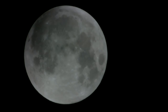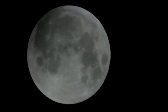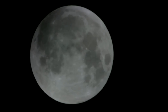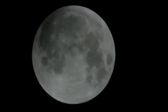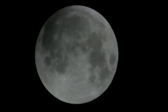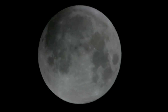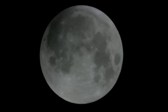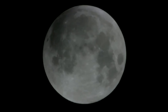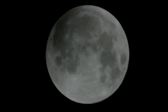We get a total view of the moon when adjusting the zoom to approximately 130mm, which equals 1200mm with the Raspberry Pi camera module. Making that homebuilt telescope point exactly to the moon is very tricky with that cheap construction. Considering the rule-of-thumb construction principles, the result is surprisingly good, however in absolute terms it is not outstanding. The celestial body moves with high speed from left to right, and with a cheap tripod you can't follow that movement.